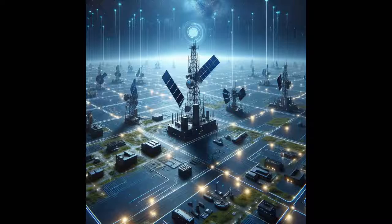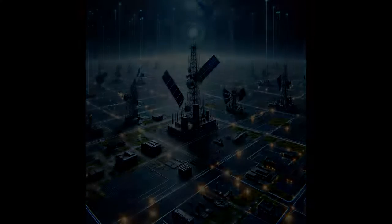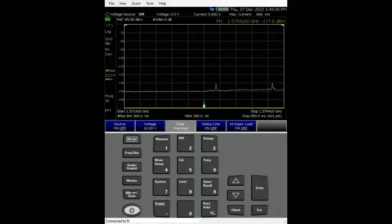There are definitely challenges that come along with it, and one of them is the limitations of FieldFox. If we set up FieldFox the right way — by turning on the preamp, lowering the attenuation, and lowering the resolution bandwidth — the most you can get is roughly about minus 120 dBm, if you're lucky and with a good receiver antenna.